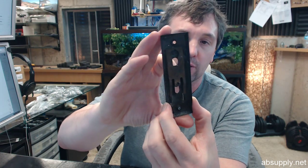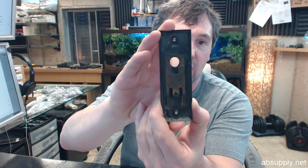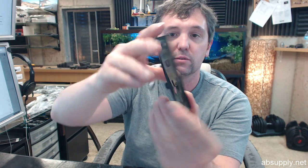First of all, you're going to have your exterior and your interior escutcheons. Obviously only different by the fact that the interior will restrict the rotation of the latch. That's in the unlocked position. The spindle will be able to rotate freely. That's in the locked position.